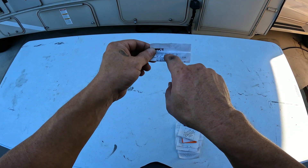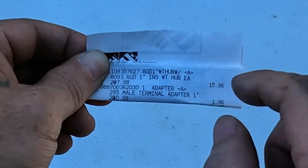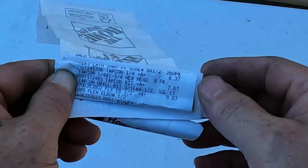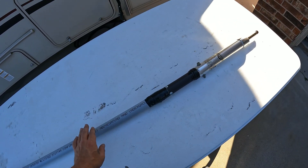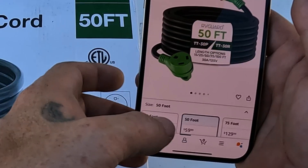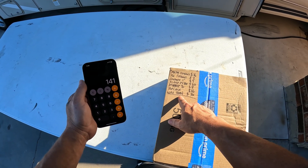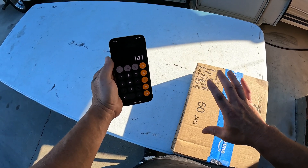The two rigid metal adapters to go into the boxes at the knockouts with that red insulation ring — $7.98 each, so $16 total. Not necessary, but I think it ends up being a better install. Two PVC adapters — $2. On the tap cons: $8 for the bit, an 8-pack of screws with four left. The actual 30 amp panel was $56. The one-inch PVC, four feet long cut off a piece — normally about $9 for a ten-foot piece. The 30 amp breaker was $8. The actual extension cord came in at $60. If you need bigger: 75 foot is $130, 25 foot is $36.